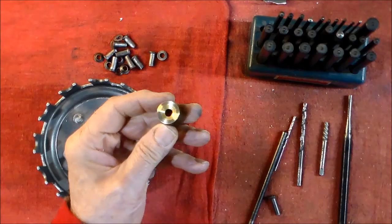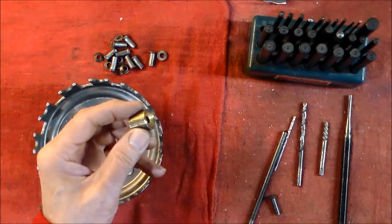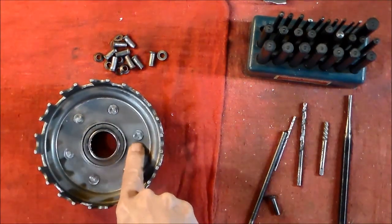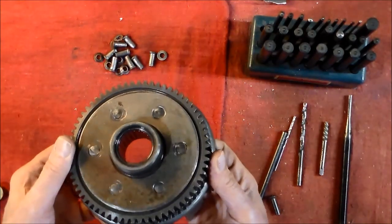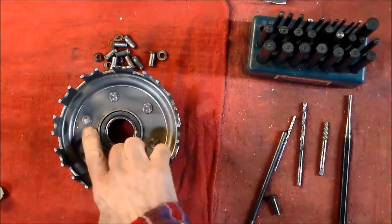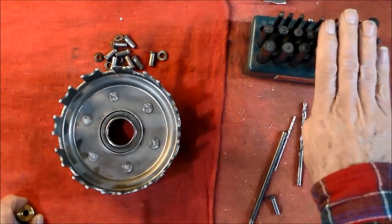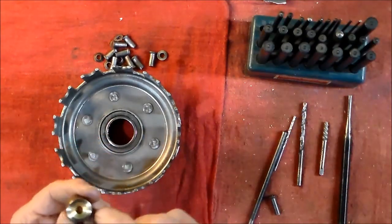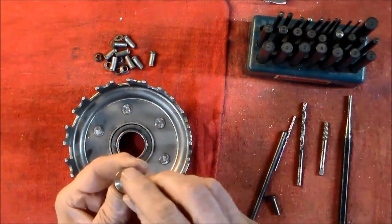I made this up — it's just a brass guide. It doesn't have to be brass; it could be anything: plastic, nylon, aluminum — doesn't matter. All it does is fit over the head of these rivets that were peened. You'll notice on the back side the peens are smaller, so these seem to be of uniform size. I also have a set of transfer punches, and I machined this to fit the head of the rivet.